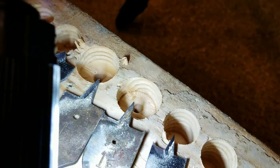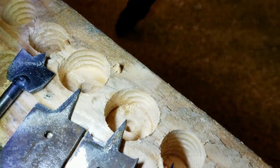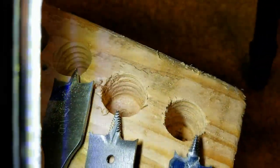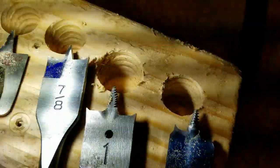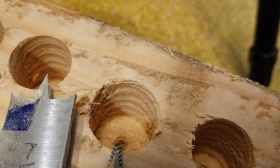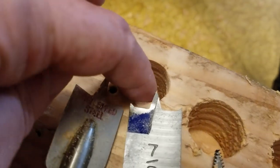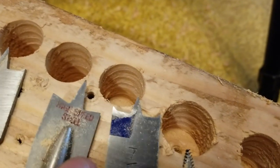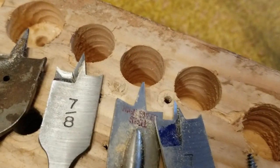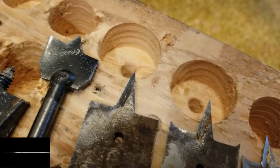I've got all these bits lined up with the holes that we drilled. Something I'm noticing is that the bits that have the worst or least aggressive geometry actually leave some pretty nice smooth holes — it must just be the nature of those types of bits. These earlier bits I started out with, like the Bosch Daredevil, actually do leave a pretty smooth finish given how fast they run, but it isn't as smooth as some of the others. That would be the older style Bosch. The newer Irwin Speed Bore actually didn't do too bad at all. This is an inch bit here, and it may have been a little bit too much speed. The high-speed steel Miller's Falls did pretty nice. The Master Mechanic — not so great.